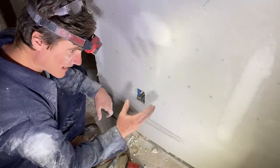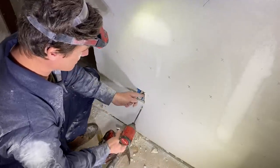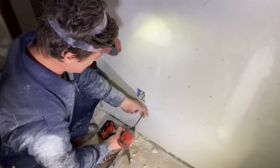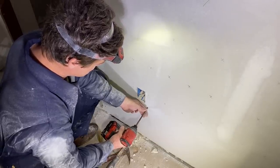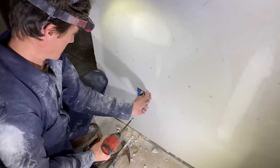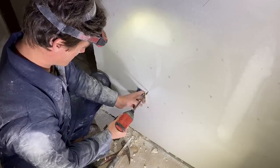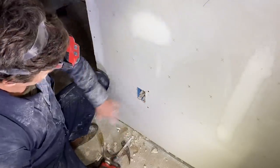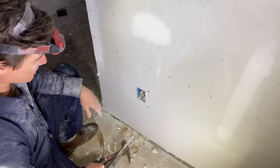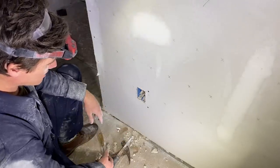So when you miss a box like this, and I've done it myself before in a house, you can see now the drywall is a little loose feeling. So you just come over to the side where the stud is. Now it is tight and you should be good everywhere else. And right here where I backed those screws up, this gets covered up with the trim. So now that is set to where it should be, just behind the surface of the drywall.